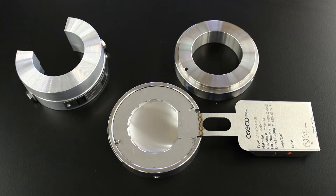The ProPlus KRGL has a KR value in gas and liquid service of 0.69. The ProPlus has a KR value in gas service of 0.29. The ProPlus KRGL is designed for use with the PRDI or insert type rupture disc holder, or the PRDI-P or pre-torqued insert type rupture disc holder.